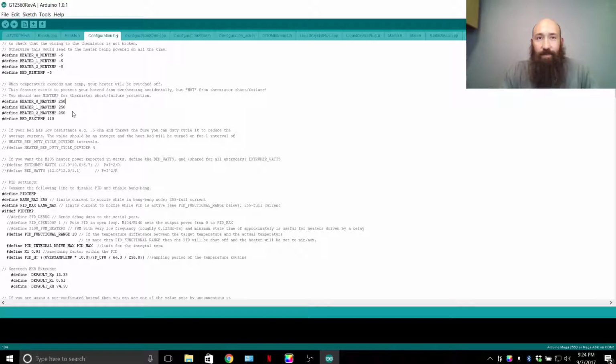And if you're going to be printing at high temperatures, such as for polycarbonates or PETG, things like that, higher temperatures, you might want to switch out your barrel with an all metal barrel versus the PTFE liner barrel. PTFE liner provides a heat break, essentially insulating heat from creeping up your barrel into the extruder gears and then melting the filament instead of moving the filament.